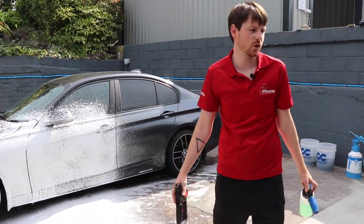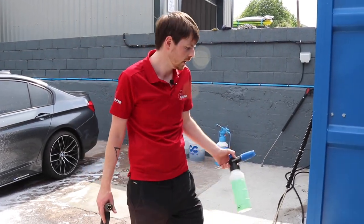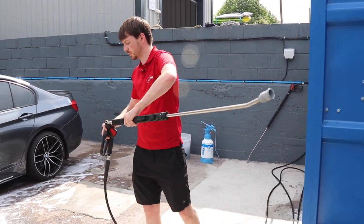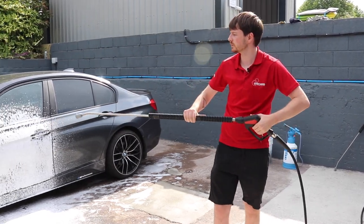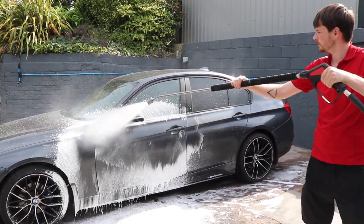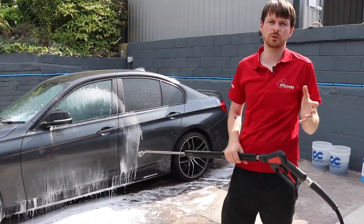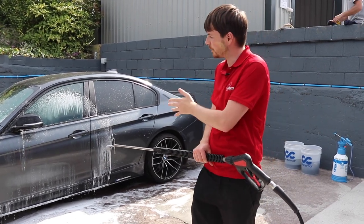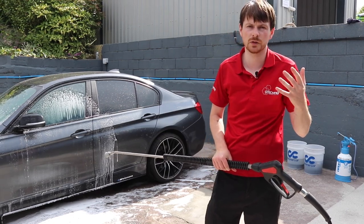You'll also hear in the background a great thing about the KM300 - they actually have a 25-second delay. So if you're washing a car and want to rinse off what you've just put on, instead of the machine turning on and off repeatedly throughout the car wash process, it stays running. That means the machine isn't getting extra wear or starting up more times than it needs to, so you can swap very quickly between snow foaming and rinsing while the machine stays running.